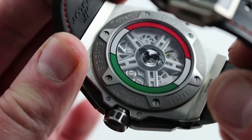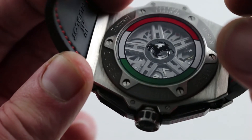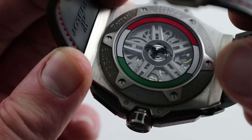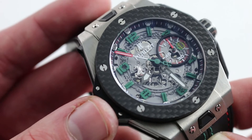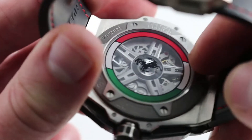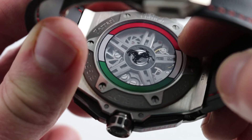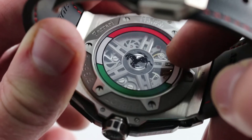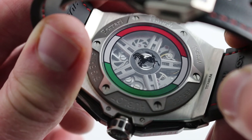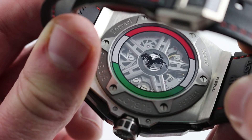On the case back you can see Mexican green, white, and red. The Cavallino is at center and underneath you can see the Hublot Unico caliber. It operates at a modern 4 hertz or 28,800 vibrations per hour. It has a three-day power reserve, so you can put this aside — put it down Friday afternoon and pick it up Monday. It features modern silicon pallet and pallet fork in the escapement, so that portion operates unlubricated for long wearing durability. The Unico caliber, developed entirely in-house, is a unidirectional automatic winder with unlubricated ceramic rotor bearings — high-tech materials designed to make the movement wear better over the long term with less maintenance.